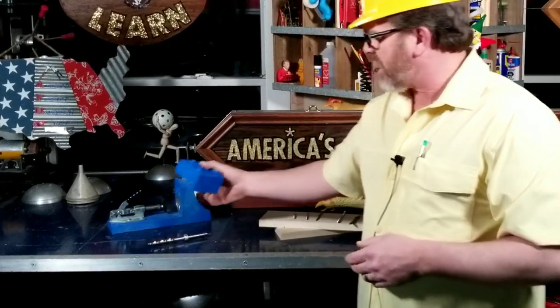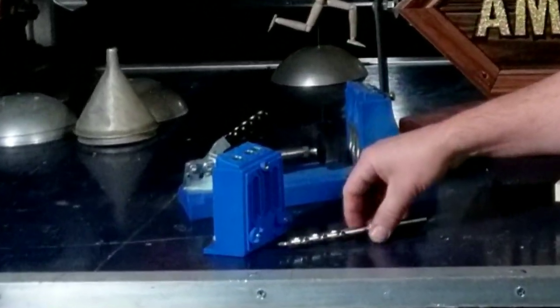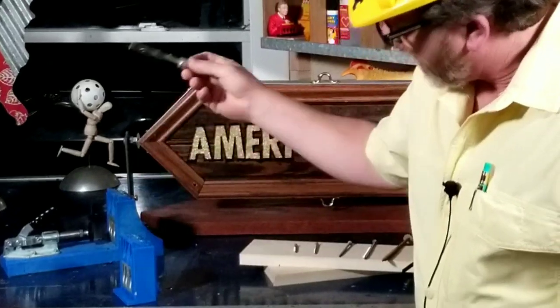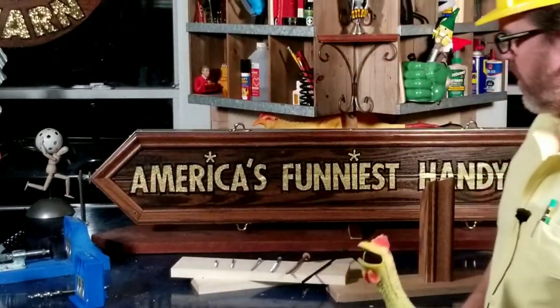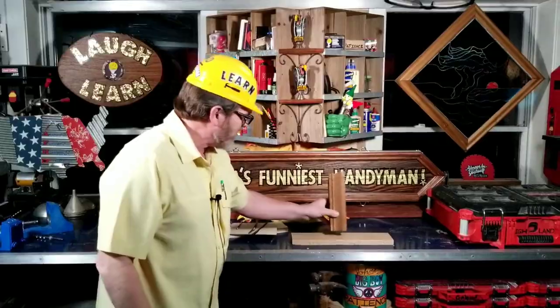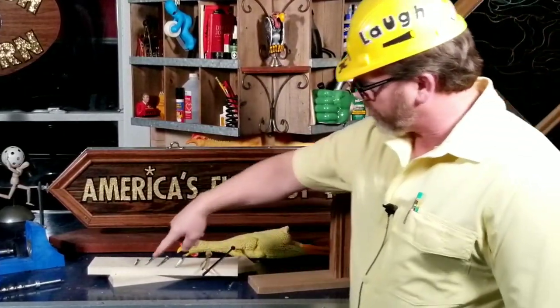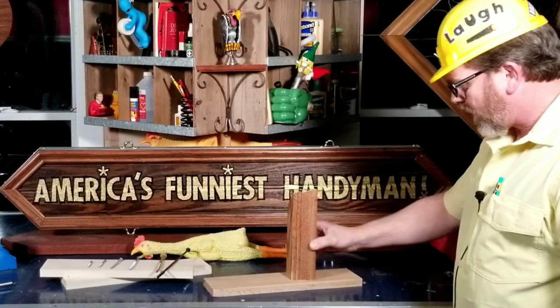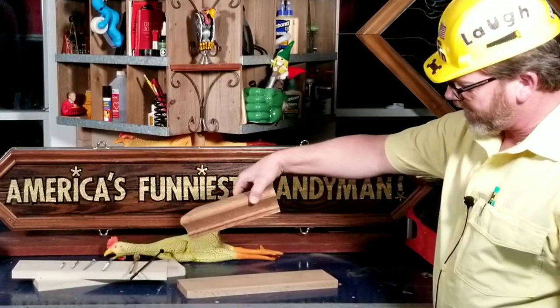In the late 80s, a nice guy from Iowa invented a jig to make pocket screwing very uniform — it basically just keeps a very specialized drill bit at a certain angle. I'm going to show you today how to get that same angle using your own drill bits. Using pocket screw joinery is one of those things that will really up your game as a carpenter. Pocket screws come in very handy if you're out in the field without a pocket screw jig, or if you're doing funky moldings where the jig really isn't going to fit very well.